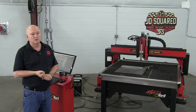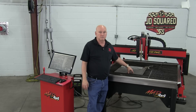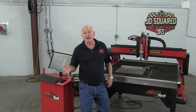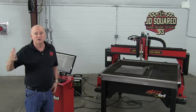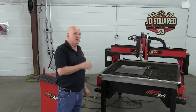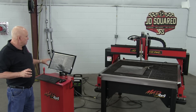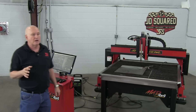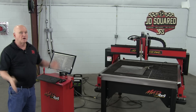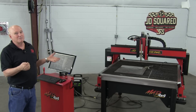Another possibility for trouble: let's say you're cutting aluminum. If you take standard air-plasma consumables and start cutting aluminum, it's going to be a disaster. You're really going to have to use an inert gas — nitrogen or something — because aluminum doesn't like to be air-cut. On our lasers we go through a ton of nitrogen cutting stainless. You've got to match the correct gas to the material and to the consumables. If you do all of that and go by the guidelines for all the settings, these things are pretty much turnkey. Our machines are designed to run 24/7 with no duty cycle — just run, run, run — but once again, the machine's only job is to put that torch where it's supposed to be.